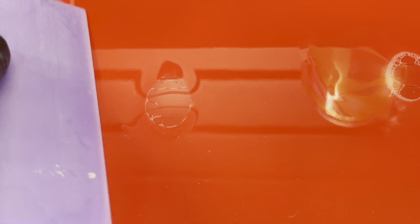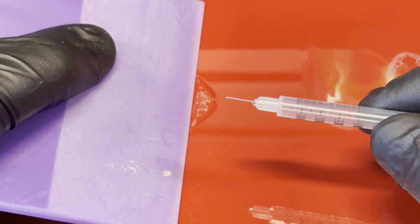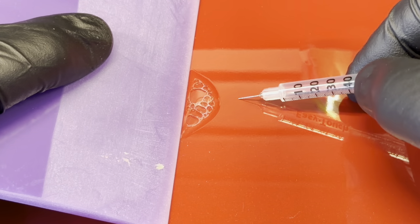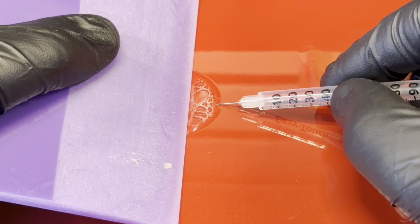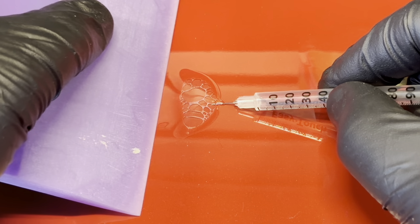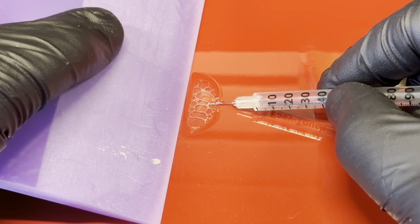For this example, these are oversized water pockets — clearly not recommended, but we'll use them for visual aid. Bevel facing up, flat side down — I'm just going to squeegee some of this over. You can see the ridging where it's putting tension along this section; over here is already tacked, this side is still free-floating. We're trying to minimize the pocket, so we'll enter in. You can probably see on the camera there's a little bit of moisture that's already come out. Normally this would be smaller, but you should be able to see the fluid passing into the syringe.